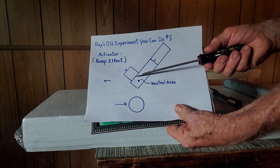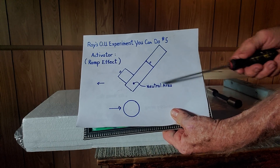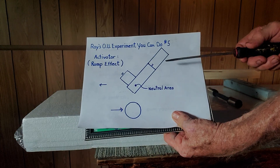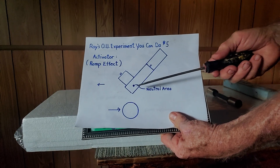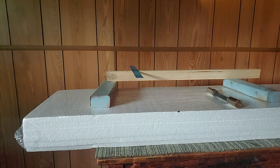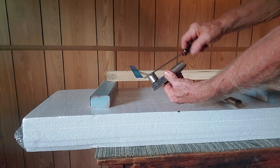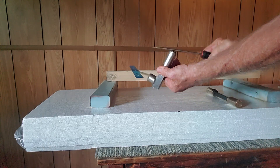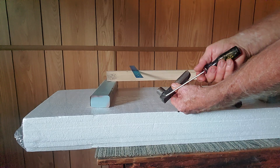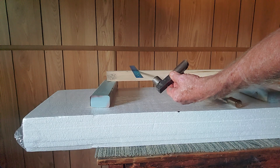Whenever there's a south and a north junction — south, north, north, south — there is a neutral zone or neutral area. These neo-magnets have pull-off forces well into the hundreds of pounds, so we have a lot of magnetic forces. And yet at this junction, this metal is a neutral zone. The junction between a south and a north, and a north and a south, has no magnetics — they cancel or neutralize each other out. That's the other principle being used: neutralization.